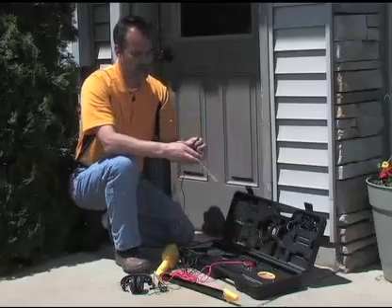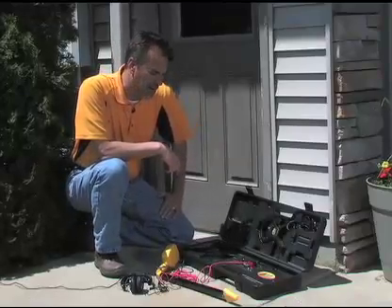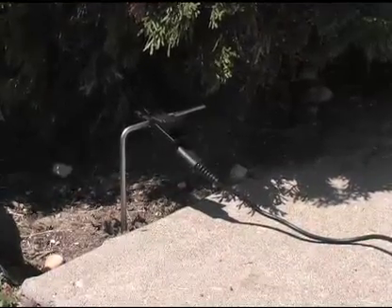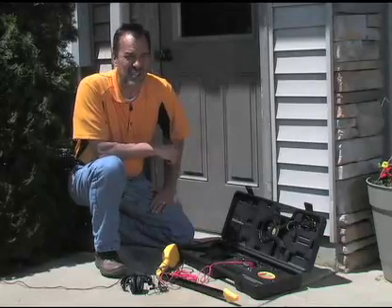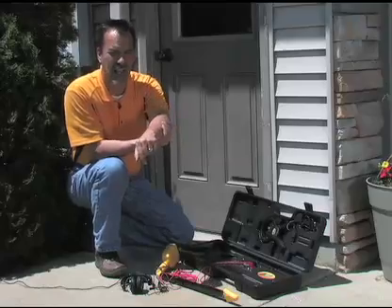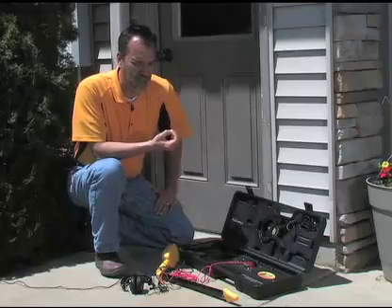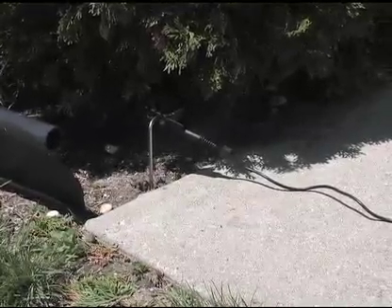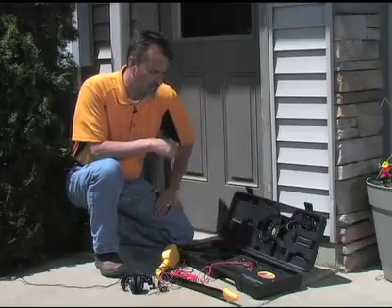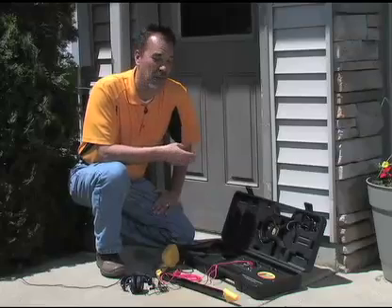This is the ground stake — it comes with the unit. Take the ground stake, connect it to the black alligator clip, and set it in the earth ground — actual soil ground. We want that to be an independent ground. If you use a common ground, sometimes your signal can get a little dicey. An independent ground is much better. We suggest you use an independent ground first; if that doesn't work, then try common ground. When you set up a locator like this, you're transmitting a signal down the cable you're trying to track, through the ground, into the actual dirt ground, and back to this ground stake — you're setting up a circuit. If that circuit is discontinuous or open — for example, if the lead is not connected to ground or you have a bad connection — you will not get good current flow, and you will not get a good signal, and you will not be able to locate that cable. The transmit light will blink brightly red if you've got a good ground; if it's weak, you do not have a good ground; and if there's no light at all, you have absolutely zero ground.